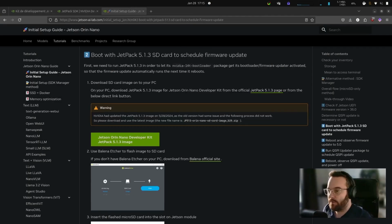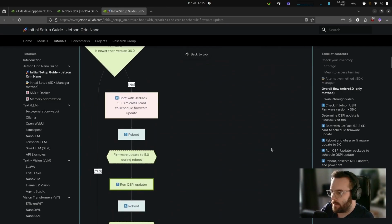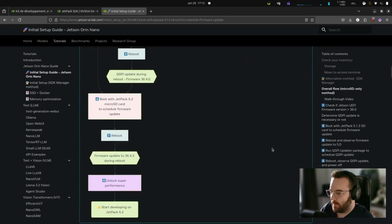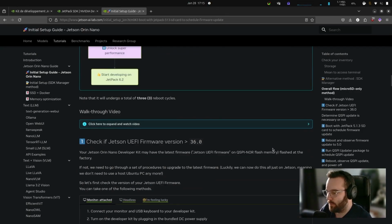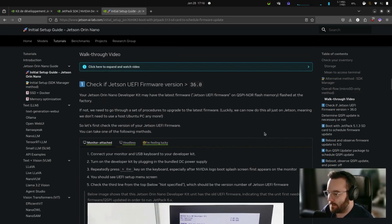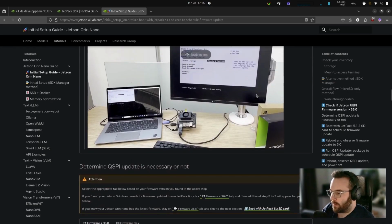That's it. I finally managed to install the Jetson. And indeed, there were a few intermediate steps that shouldn't be forgotten. It's a developer kit, of course. You need to update the firmware because it just came out, and the firmware isn't up to date. Anyway, the NVIDIA documentation is well done. There's an initial firmware update that needs to be done using an earlier version of JetPack.